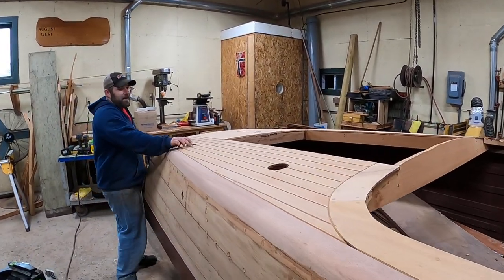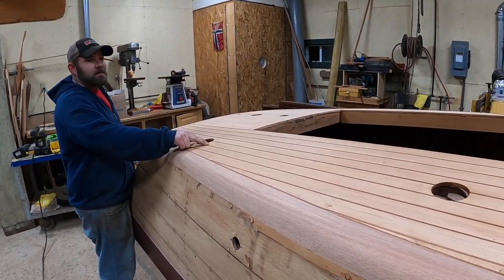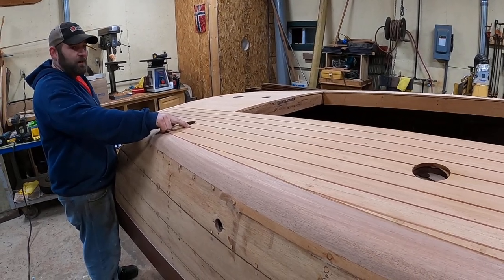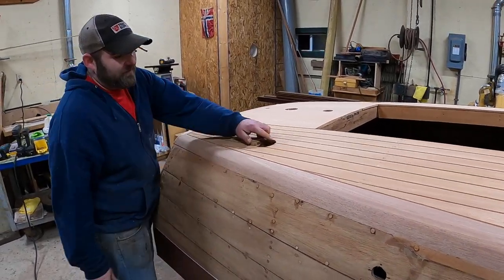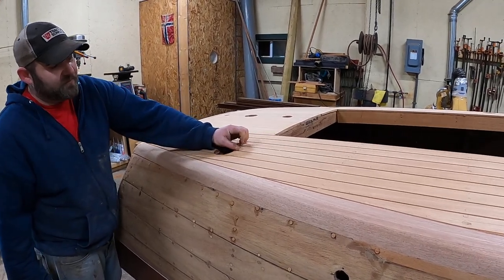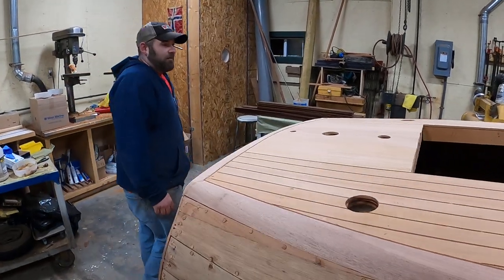As you can see, all of these lines are very, very close. What I do is I start with a smaller bit because I'd rather go smaller and have room for sanding all of these, so that way it's not just a square valley. You have a little chamfer along the sides of it so that it won't spill out.